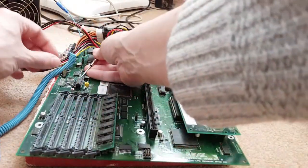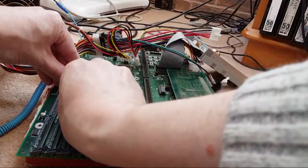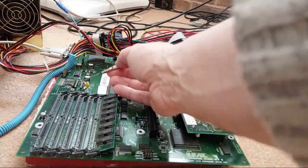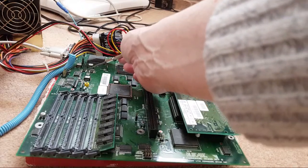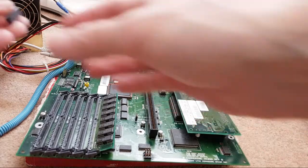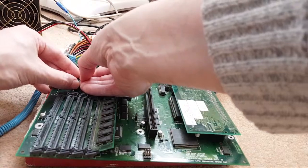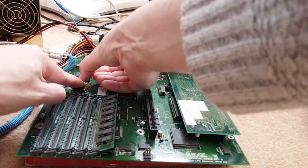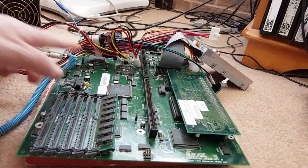It's just cosmetic stuff now. And cosmetic is purely cosmetic. What I mean is just tidying up some of the solder points. I'll go to this with a bit of solder, a bit of flux, reflow the odd thing where I've been probing it a bit, because you can see marks on the pins where you've probed them fairly intensively. So there's an odd chip that I'll have to reflow, and a little copper trace to cover up, and there'll still be the odd corroded via in places where I think, I really should scratch the surface of that on both sides, tin it up, and you can plug them.